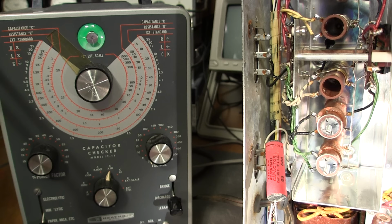But it'll just be interesting to see if it actually does, because the receiver looks like it has such low time on it. Now, granted, this capacitor is just across the speaker terminals, so it really is in a low voltage application. It probably would live in this receiver just fine, but it's just a good idea to get rid of any capacitors that are a paper style capacitor, because down the road, chances are it will end up leaking at some time.